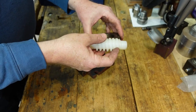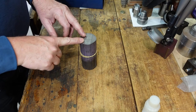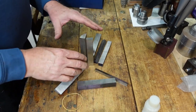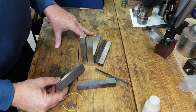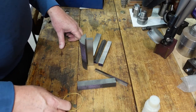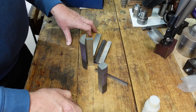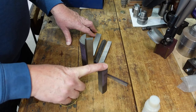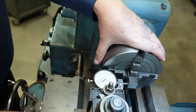To start cutting my worms I've got a bit of round bar stock, and using techniques from the bandsaw video I've cut it into a bunch of pieces. The rest won't go to waste. This is actually EN25, which is akin to something like 4140, and will be fine for these. Usually with worm gears you make the worm gear from phosphor bronze or cast iron and use a hardened or harder worm, so the wear occurs in the worm gear rather than the worm.